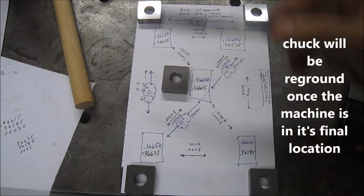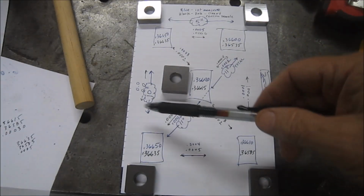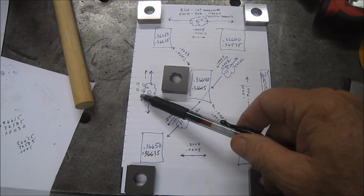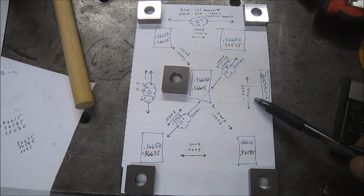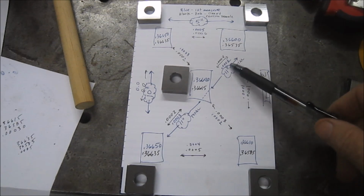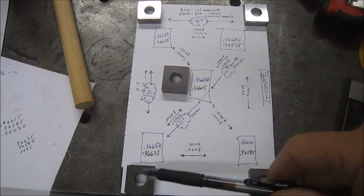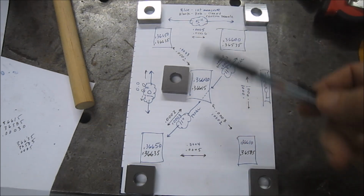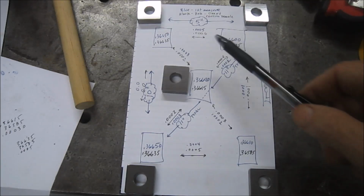So basically, from right to left, the longitudinal direction of the chuck, it's basically 10 inches of grind that I did, and ended up with 0 difference. And on the wheel side, 1/10 over 10 inches. Diagonally on the 11 inches, I ended up basically at about 5 to 6/10 all the way across, and that's over 11 inches. And from side to side, 5 inches, 4 to 5/10 of difference.